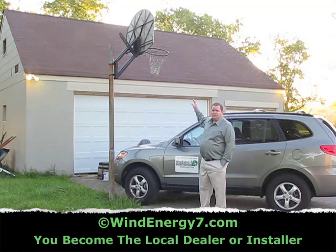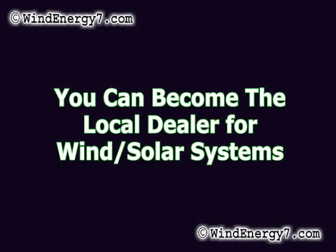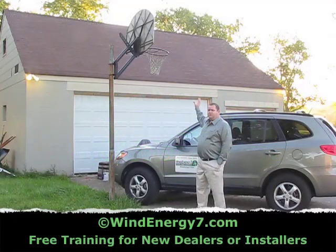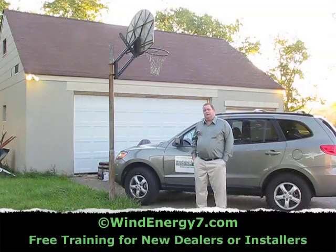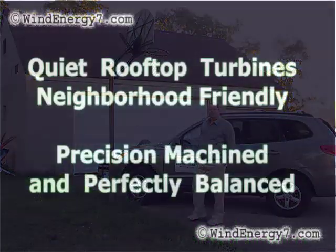Today I'm going to put three wind turbines on this roof — one, two, three. That's about as small a rooftop as you can concentrate three turbines. You have to keep a spacing of approximately eight to ten feet apart. Then I'm going to put six solar panels with that. In the garage we're going to put an inverter, battery bank, and everything we need to power this three-bedroom.